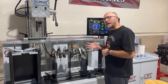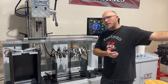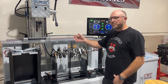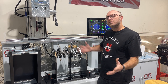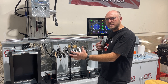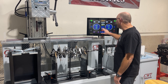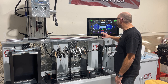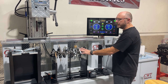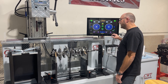I don't want to use that same standard as an impossibly hard-to-achieve standard for some stock GM 396 or 454, or a big block Ford or Chrysler — they shouldn't all be held to the same standard because they don't have the same weights and out-of-balance properties. So that said, I'm going to type in 750 here because I know I have a pretty small amount of imbalance right now. I have a 1360-gram bob weight calculated on this thing, so I'm just going to hit go and let it spin.